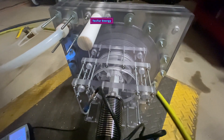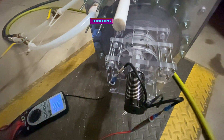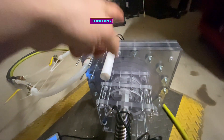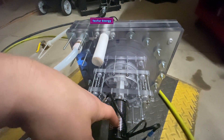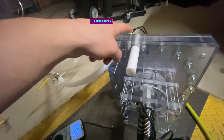The last time I tested this it was coming in at about 3.6 volts, which means the turbine was going at about 2,200 RPM and the generator was going at about 7,900 RPM.